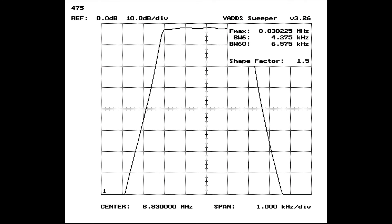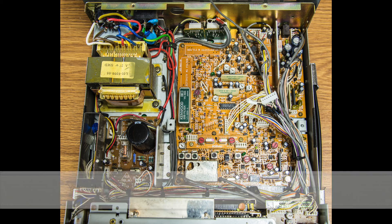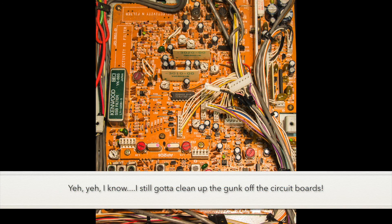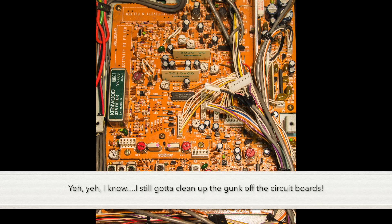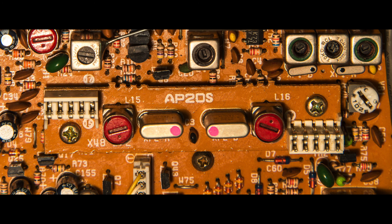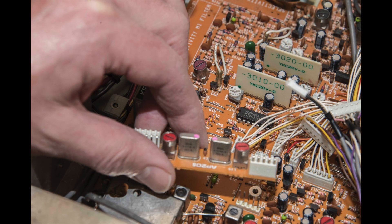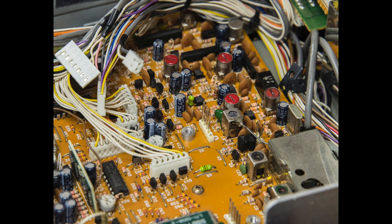From their website, the printout of the 4kHz filter shows a shape factor of 1.5 to 1.6 — that looks really good. With the top cover off we can see where the filters go. There's the AM and SSB filter, and that's the offending AM filter we want to get rid of. It's got two screws, one on each end, and we unscrew those and rip out the old filter.